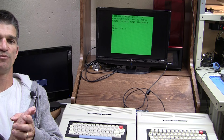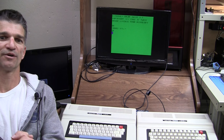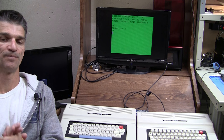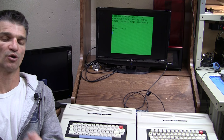There you have it — composite video mods made simply for either the vertical or the horizontal RF modulator, mailed to you in kit form so that you can solder it up yourself. And if you want to install one of these in a CoCo 1, you can do that — you'd want to order the Markdata Products board, the one that needs only the 5-volt supply, and I can give you the connections you would need to connect that board into your CoCo 1.